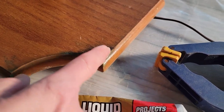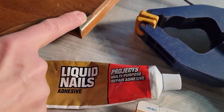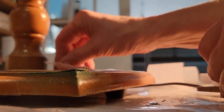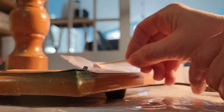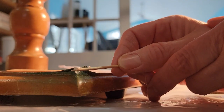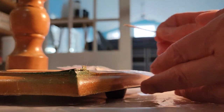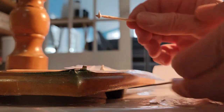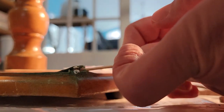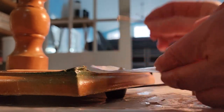Here was the spot that the veneer was lifting, and I needed to get some glue underneath there. I believe it was some type of cleaner maybe they were using to clean it with, because it was not mold. It did not smell like mold. It was just like a weird spot that looks like it may have been punky at one point there in the corner. So the best I could do is try to get as much glue underneath that little flap. And there was even a little bit more sticking up to the right of that, just a little tab almost. And get them pushed back down and get enough glue back inside there and put enough pressure on there. Maybe I could make it a little bit more of a solid piece again.